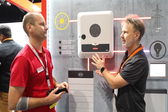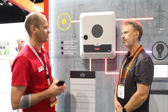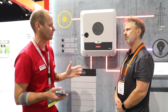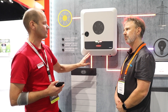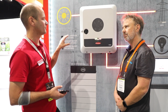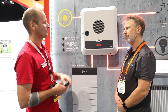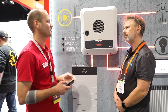In terms of monitoring, there's no screen — we've done away with the screen, what's going on there? Because it's a hybrid inverter there's just too much information to put on a screen. The snap inverters will keep going and they'll still have a screen, but once you get to a hybrid there are too many energy flows. With this you can also have multiple smart meters — the main one at the switchboard gives you all energy flows around the house, but if you want to measure individual loads you can put up to four meters on the RS485 bus. Once you start having that you just can't put it on a display anymore.